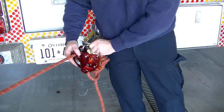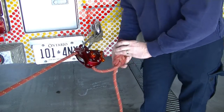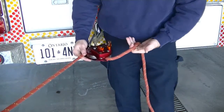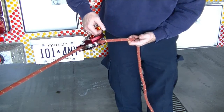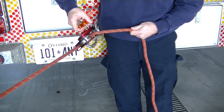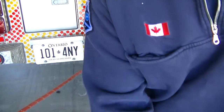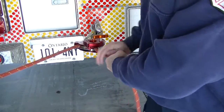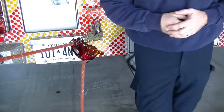There is no way it can travel. To descend the device once more, remove the nut, take hold of the running end in my free hand, remove the lock, and again turn the throttle counter-clockwise to descend the load. Let go and the load stops. To retrieve the load, pull up — it is self-camming, so I can simply pull up without manning the throttle, and when I let go it self-arrests.